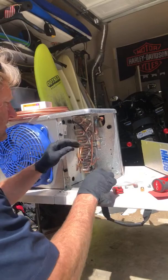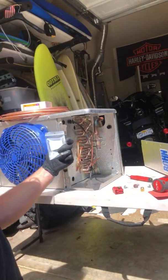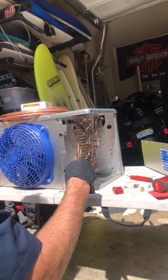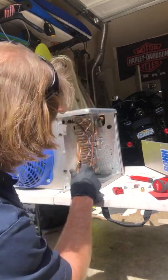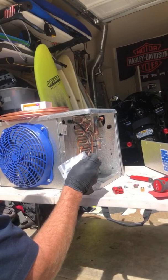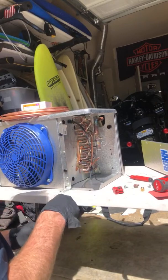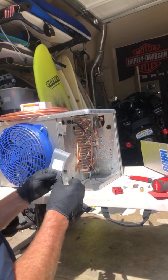It's not a metering device. All this is for, in theory, is to stop what they call the slip. And the slip is if you're going straight in and one distributor might get more refrigerant than the other. This is made so that even amounts of refrigerant will go to all your distributors. Remember, some distributors will have heaps of tubes coming off of them on bigger coils. Will your unit still work without this in there?